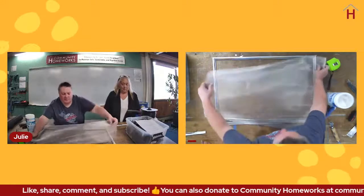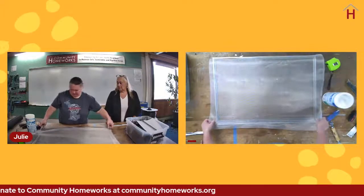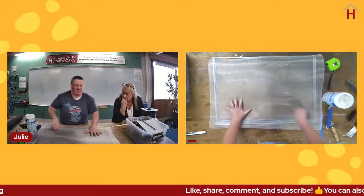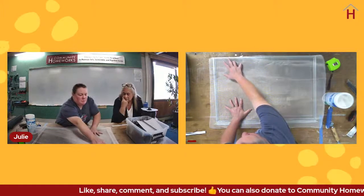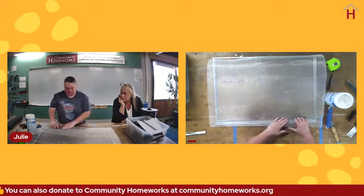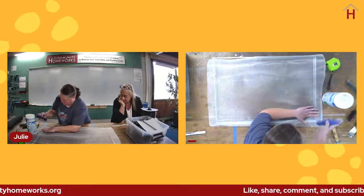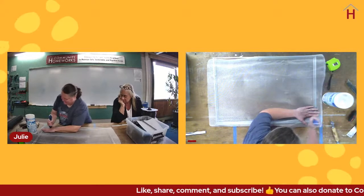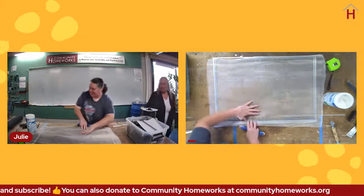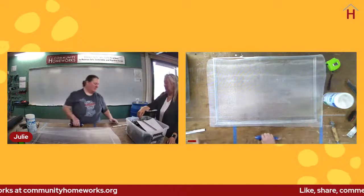And so if I ended up putting this in and it was crooked and I was unhappy with it, I'd have to start over by moving it down a little ways so that that crease wasn't part of it anymore. And as you can see for this screen, that would be pushing whether or not I have enough left over at that edge. So maybe with metal screen, it's good to cut even more leeway around all four edges, just in case. It probably is a good idea to give yourself a little bit more and buy extra, because I can guarantee that your first try may not be successful. The second may not be successful either. Some people may be naturals at this, but it's certainly a possibility.